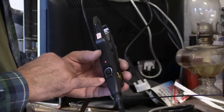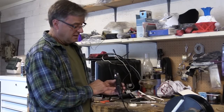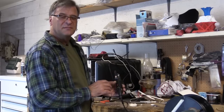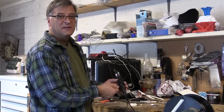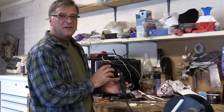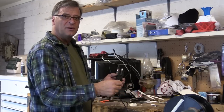So one of the things I did not quite understand was — not only does this tool have the on-off switch here, but it also has this knob that goes from 100 to 220. Originally I thought that meant 100 volts or 220 volts. No — this is a temperature gauge. When I got it out of the package, this adjustment knob was actually all the way maxed out past 220. So when I tried it for 30 seconds the first time, it melted it just fine and fused it together, but it made it brittle — trying to bend it, to roll it, to put it on the spool — it just snapped.